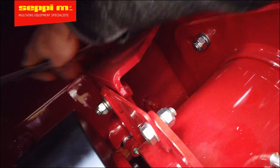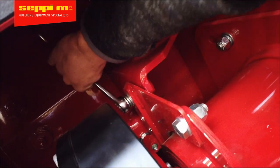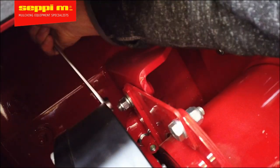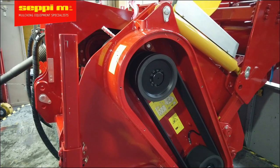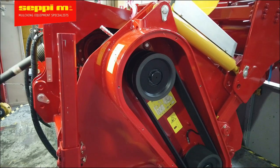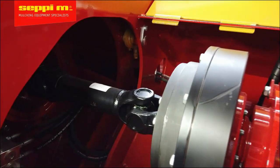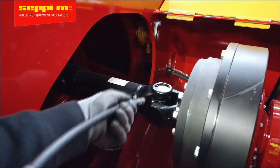Before closing the covers on the machine, tighten all the bolts related to the adjustment, then start up the machine one more time and check to see if that setting remained. If you don't see any more movement, your belt is aligned. Now's a good time to do remaining maintenance like greasing before we close the covers.